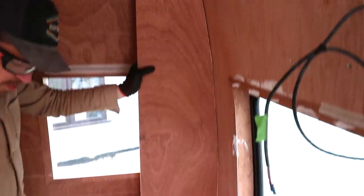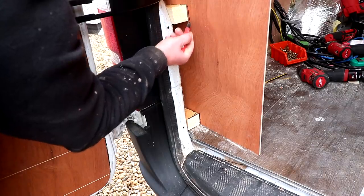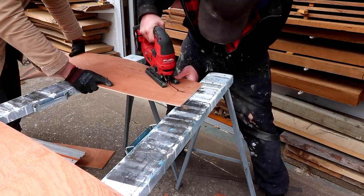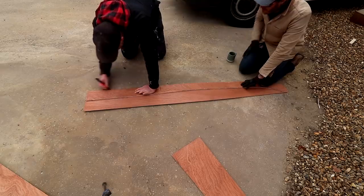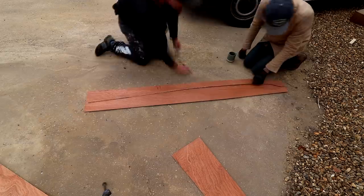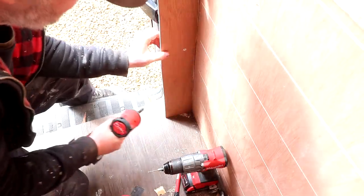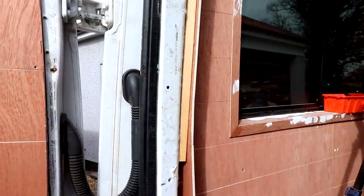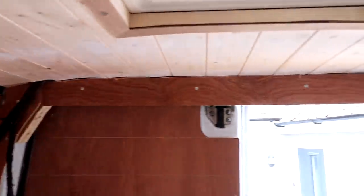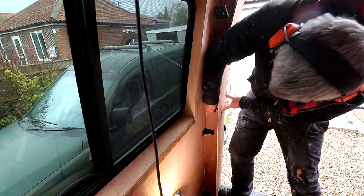After a few adjustments it looked a good fit. We then made marks to indicate where to remove more material, but allowed an additional 10mm overhang so we could flush trim it later. With the first piece cut to shape we used it as a rough template for the pillar on the opposite side, knowing it probably wouldn't be a perfect fit first time. We fitted the panels to the wooden battens, and you can see that 10mm overlap. With the sides done we scribe-fitted the top panel to the arc on the ceiling and got that mounted too. Then it was yet more scribing to fit the inner panels, which butt right up to the pieces already added.